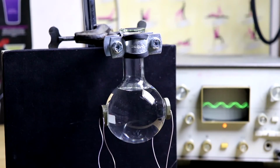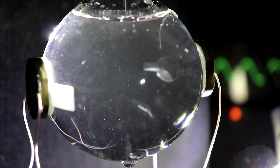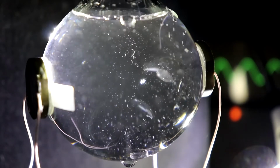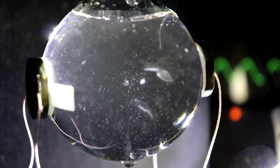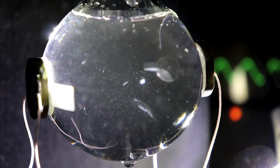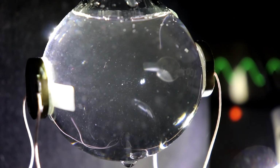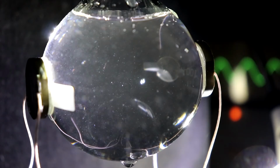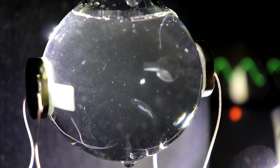The voltage applied to the surfaces of the piezoelectric emitters causes mechanical deformation. The greater the voltage, the greater the amplitude of the deformation of the piezoelectric element, which is transmitted to the acoustic chamber. Bjerknes forces affect the microbubbles that have fallen into the chamber. If the ultrasound frequency is close to or equal to the resonance frequency, the bubbles will begin to move towards the center of the bulb.